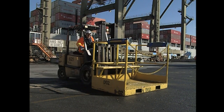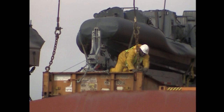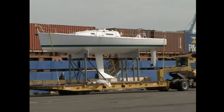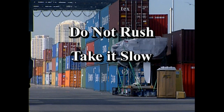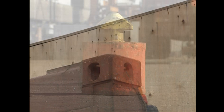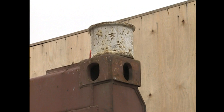Never take your eyes off the workers who are engaging or disengaging the auxiliary gear — allow them to completely finish their task before you think of moving. The boat cradle beam is used to handle only yachts or sailboats. Special padded slings are attached to the cradle and placed around the hull of the boat to be lifted. Do not rush when moving boats — take it slow and easy so the lift is completely under control, and make sure taglines are used to control the boat's turning. Dumbbells are used when the spreader is unable to lock to a hatch cover or container; they are links manually installed between the spreader and the hatch cover or container. When using dumbbells, make sure all four corners are properly latched and you get the signal before lifting the load.